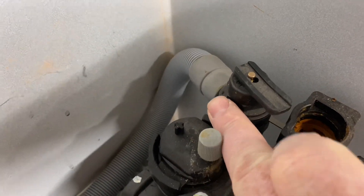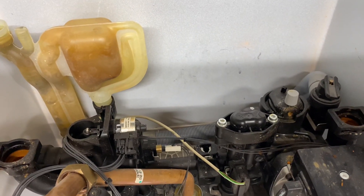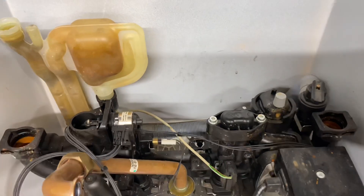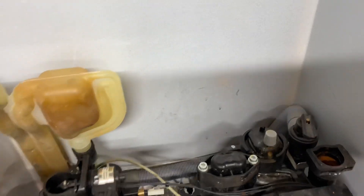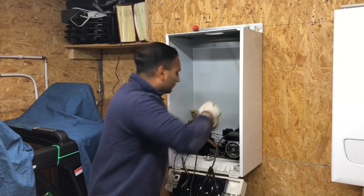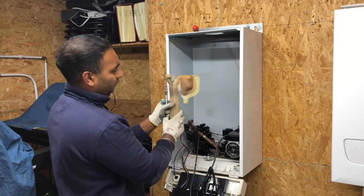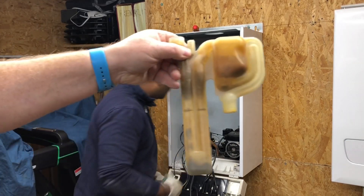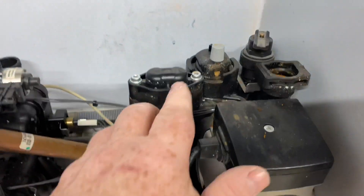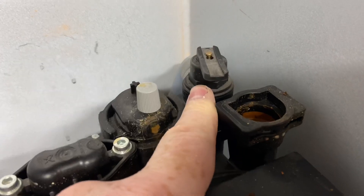You don't need an external pipe for your blow-off — it's built in. That's something interesting for trainees to know, because they might expect it to have a pipe going outside. That's your condensate trap pump on this Viessmann boiler.